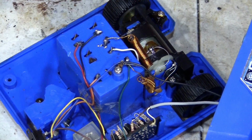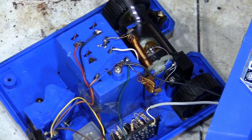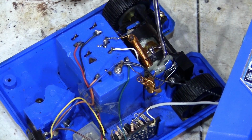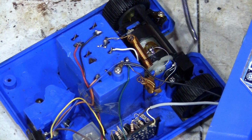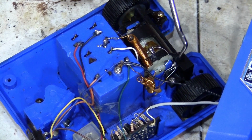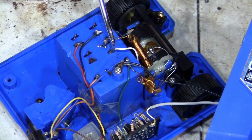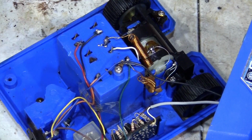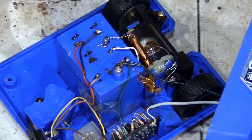So basically 4 batteries lined up have a connection in the center and then on each end. And so this side is always getting that center piece. And so the other side is either going to get these 2 batteries up here, which would make the other side positive and this side negative, or this other side is going to get this side, which makes this negative, and then this side positive. So basically, only 2 batteries are getting used at a time, and that's the kind of dumb reason. You can do it so it flip-flops, but this is easier, I guess, for them.